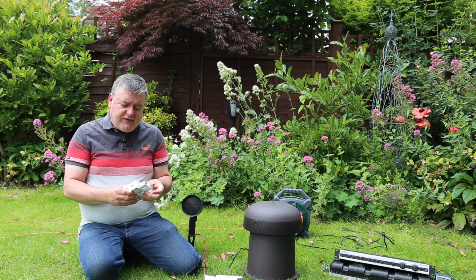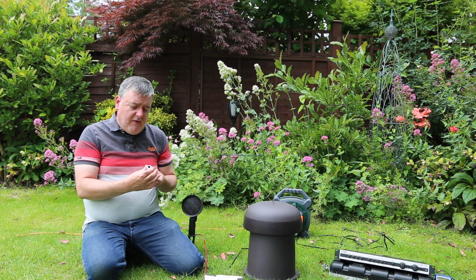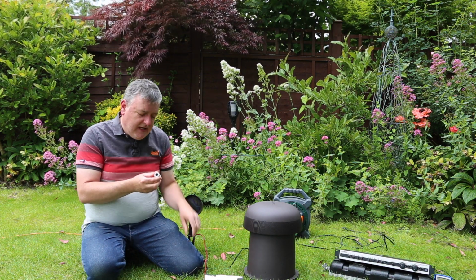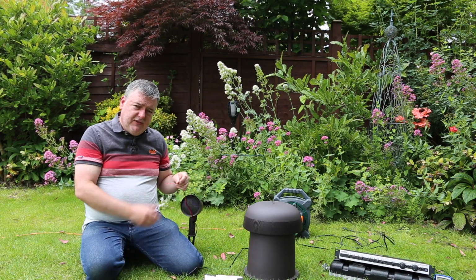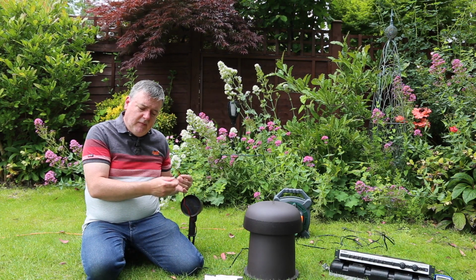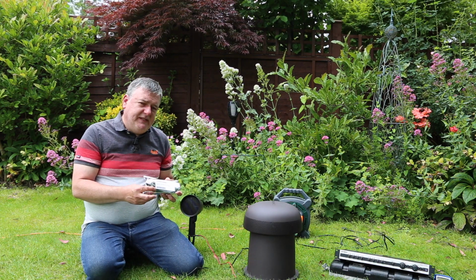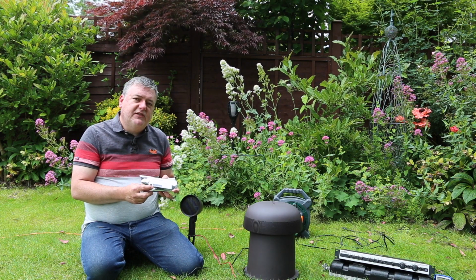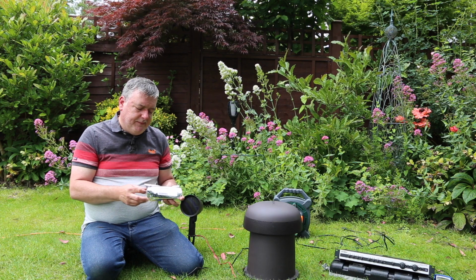Also, when you're considering using an outside junction box, one of the biggest problems you're going to have is the fact that pretty much all cable glands are actually circular, and the majority of outdoor speaker cable glands are actually shotguns like this cable here. So we've got a solution for you. It's the Son IP68 Pro junction box, and it comes with everything you need to do a really neat, tidy job that's completely immersion proof and looks really good.